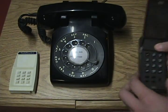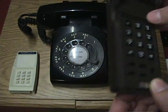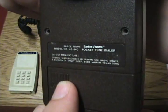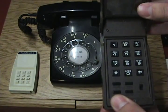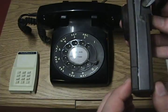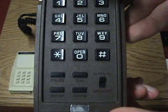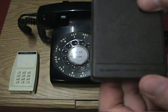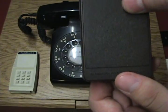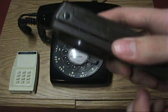If you look at the dialers here, this is an early RadioShack dialer. I've actually not found any documentation on these. This model is 43-140, and as you can see it was made in August of '83 — it's engraved right there. This uses watch batteries, whereas the newer models that everybody's talking about with red boxing use AAAs and are slightly smaller. As you can see from the keypad, there's a pause button, a dial button, a manual-to-memory switch, and enter and store for storing numbers. It's a 32-memory pocket tone dialer, though I've been unable to figure out how to store numbers on it without documentation.